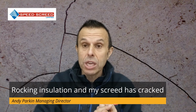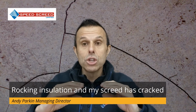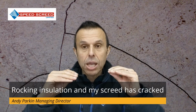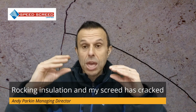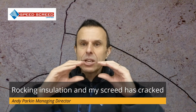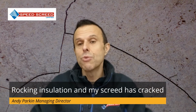Not only of the insulation. The insulation needs to be of a certain compressive strength itself, because that can compress. And if there's any movement or rocking over time, the screed could end up failing, because it is very thin, effectively. So it does totally rely on it.